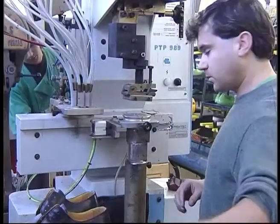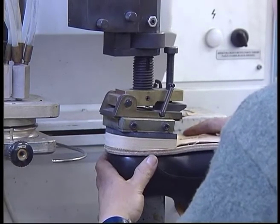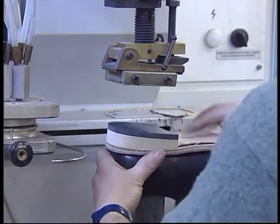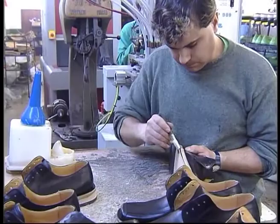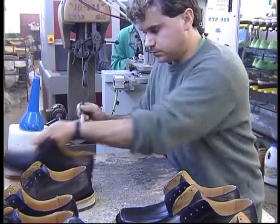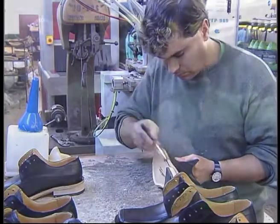To nail the heel. Before passing to the lasting operation, it is necessary to fasten the heel of the shoe. Although this has already been cemented, one has to guarantee its fixation to the sole. Equipment that allows the execution of this task in a more automated way is used. The sole type to apply will determine the execution of subsequent operations. In soles with the split, we have to make the operations of cementing the split, to rebuild the split and to do a rip. In soles with a channel, in which the stitching stays visible, these operations are not executed.